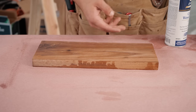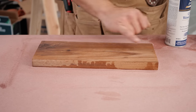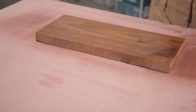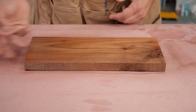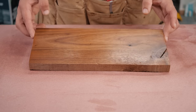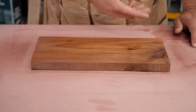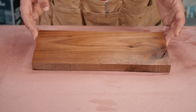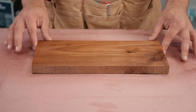You can see that's laid down perfectly — it's not tacky, starting to build a little bit of a sheen. So we're just going to give it one more coat, a sanding, and then a final coat. Now we're done — got a nice satin finish, nice and smooth, very smooth to the touch. There's a couple dings in here since this was just a piece of scrap wood and I didn't spend a ton of time sanding it, but those wouldn't be in a normal project. It just is a great-looking finish. Both water-based satin and lacquer satin are some of my favorite finishes for heavy-use furniture.